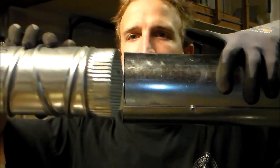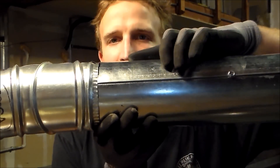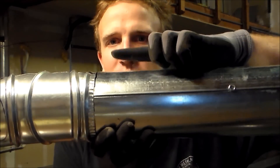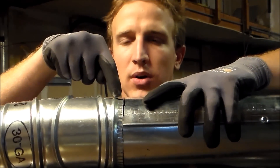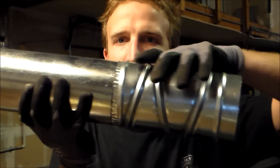...and we have it lapped to where this elbow is sitting inside like this, then we're going to have potential leaks because the air traveling through there is going to sneak up under the seam that's sitting on the inside of this pipe, and it's going to blow out these seams. That's why your lap is always important on which way your pipe is sitting inside.